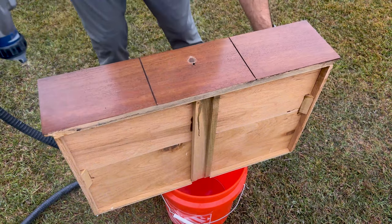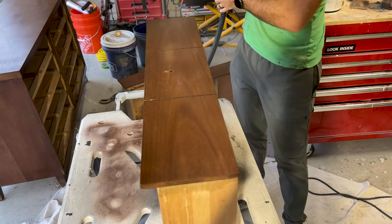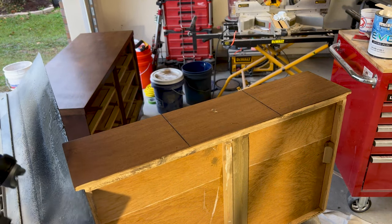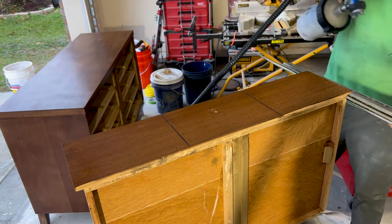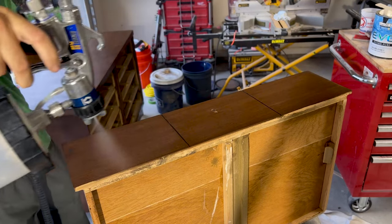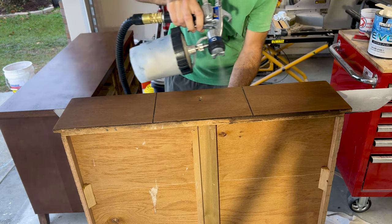I think the reason is that oil-based lacquers tend to be very fast drying and hard to atomize at the same time. And so you don't get the nice leveling like you do with water-based lacquers. I prefer to use water-based lacquer in clears. I'll probably never use another solvent-based clear.